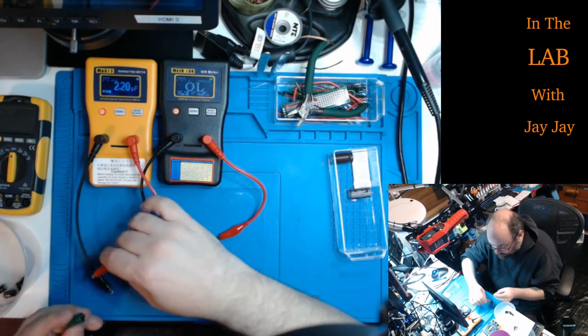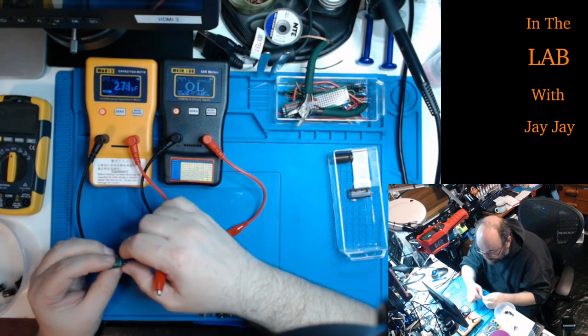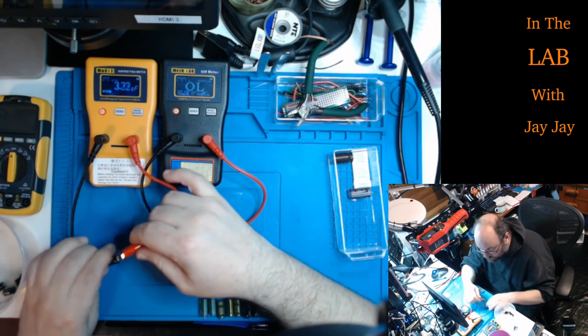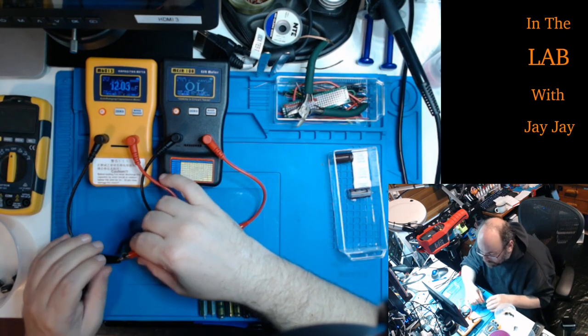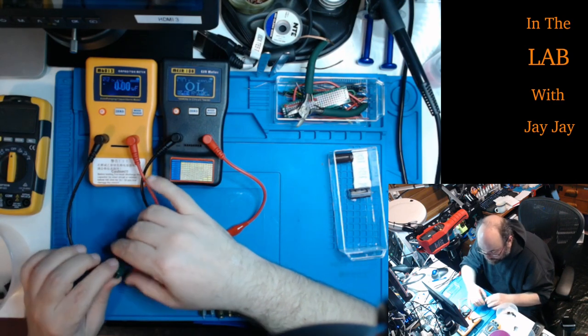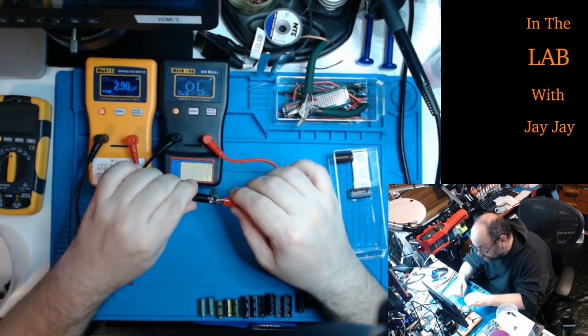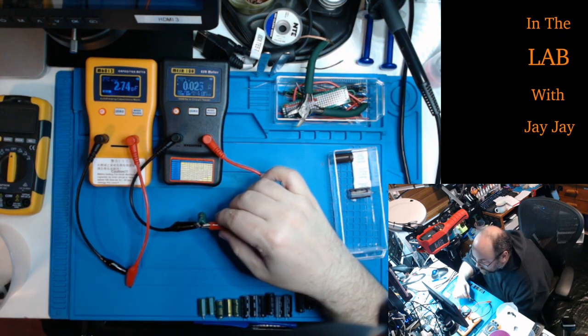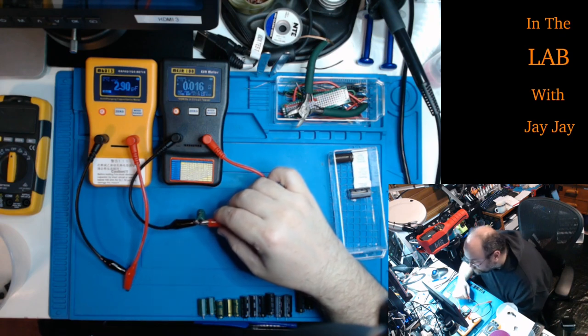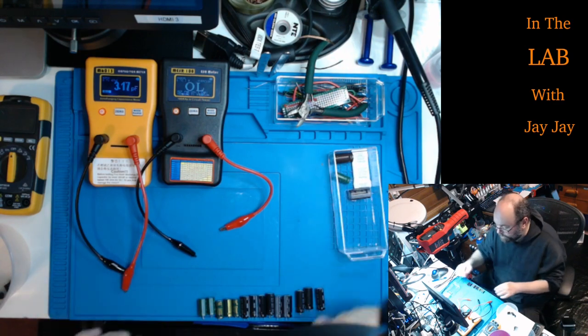So let's go. Now, this is supposed to read 1500 microfarads at 6.3 volts. Alright, up we go. Okay, it's showing 1600. That's pretty good. It's supposed to be 1500. And then the ESR is weighing in at 0.04. So this is at low voltage. And anything less than 0.1, so it's easily within spec. That's good, so here's a good one.